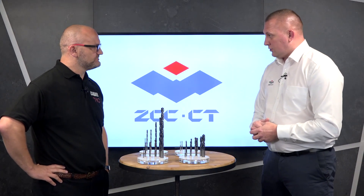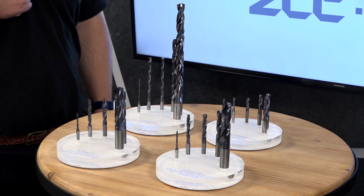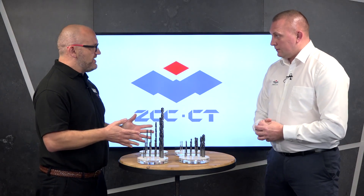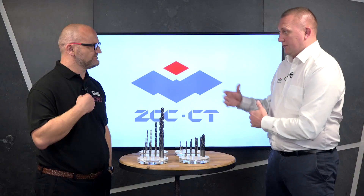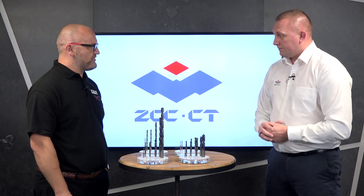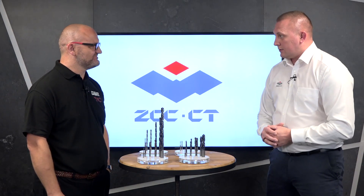This was a customer who had quoted the job. It was an unstable clamp and not a very nice application, but he needed to reduce his cycle times. He was using high speed steel from the outset, and by introducing this product we managed to save him money, which he was very thankful for. As good as the data is, it's really about stability — you're paying a significant amount for these drills, so if the process is unstable or coolant isn't great, you need to get that right first.